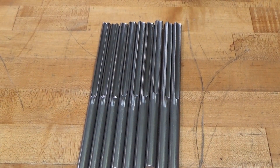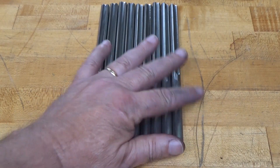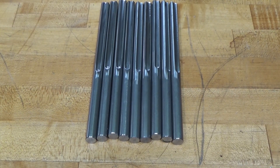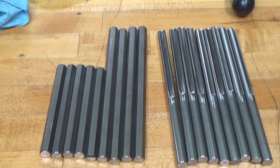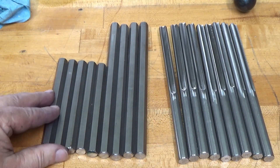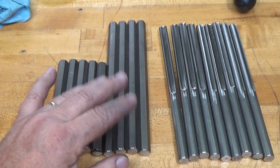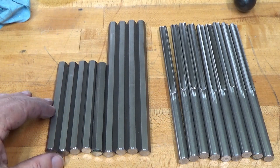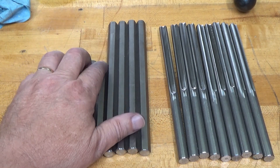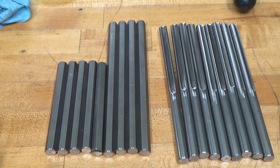Here are all nine of them ready to go and ready to machine the other end. There's another style handle that has a collet in it that takes these hex shafts, and I'm making some of those also — four of them that are eight inches long and five of them that are five inches long. All of these get the same treatment on the other end, plus a proprietary taper turned on them. Then I have to drill and tap the ends to hold on another piece — a head that actually goes on to it.